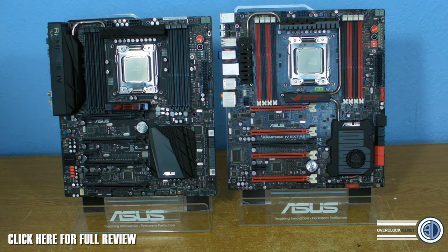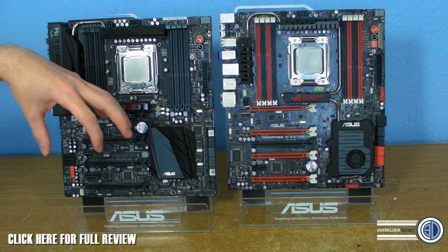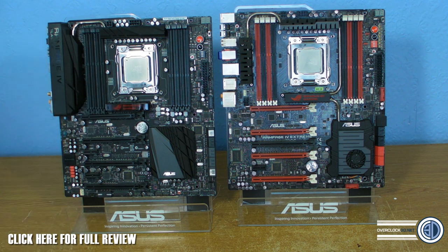There's a front audio DAC, apparently that's a Cirrus Logic CS4398. There's WIMA film caps, high fidelity headphone amp, TI TPA6120A2. They've got this weird thing now where they've got a Sonic Radar software package, and apparently there's a radar overlay, which means you can translate the in-game multi-channel audio into a radar graph to help gamers